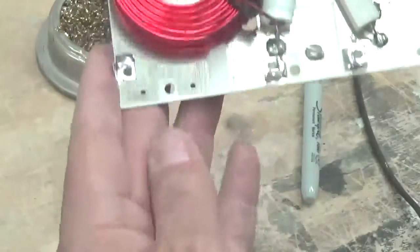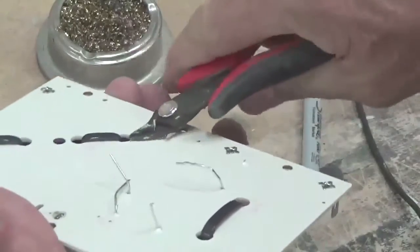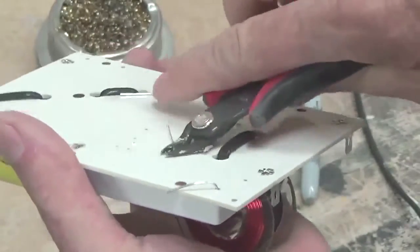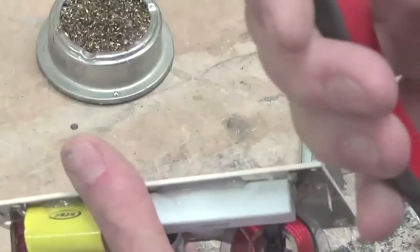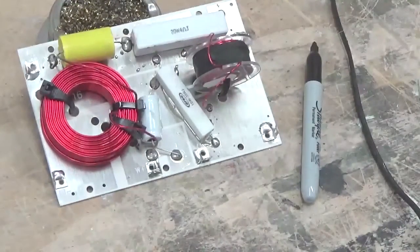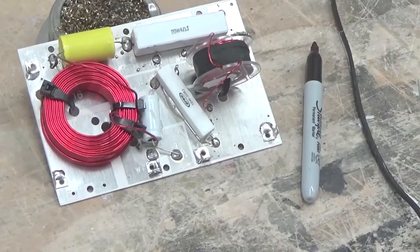There you are — that's a soldered and completed Fitzmaurice crossover. Just take your snips and clean it up on the back side. I use a pair of flush cuts — they work a lot better than standard wire cutters and they're only 12 or 15 bucks, so if you do much of this they're a worthwhile investment. So there's a Fitzmaurice crossover with parts from Speaker Hardware — that's how you put it together. Thanks for watching.